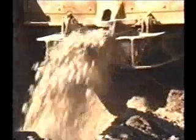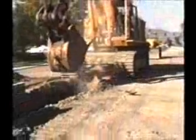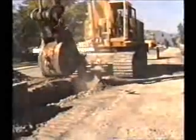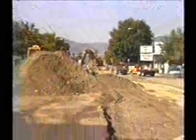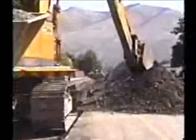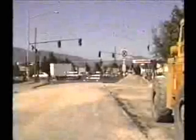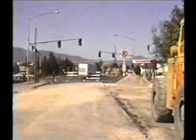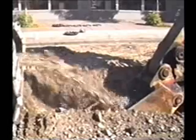There are many attachments that increase an excavator's versatility and productivity. In all situations, the bedding conveyor will increase your production, improve safety, and decrease material waste. This water job is located on a four-lane street with traffic rerouted. A number of different methods for getting bedding in the trench could be employed. This contractor is using a bedding conveyor to avoid time-consuming, unsafe, and bedding material wasting activities.